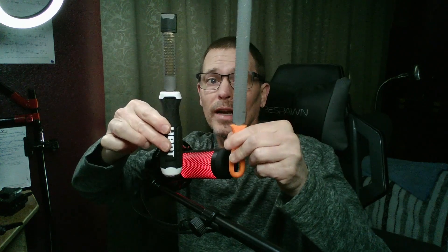When I say the Harbor Freight rasp removed more material, this was just over about 15 or 20 strokes. If you were going to be removing a lot of material — say in my blanket box with a whole bunch of holes to work through — I think over the long term it would have been better to have had the Heart rasps, just because of the handle. After a while holding something really small, my hand muscles start to cramp up. The Harbor Freight one is definitely longer with a lot more working surface on the blade, whereas the Heart's working surface is only about two and a half or three inches, but the handle is much more comfortable. So I'm going to keep and use both: for a small one-off job I'll grab the Harbor Freight, but if I know I'm doing a lot of material removal, I'll go with the Heart rasps.